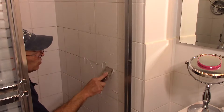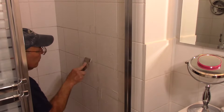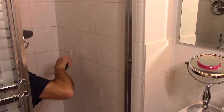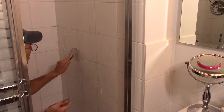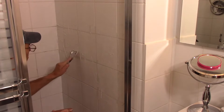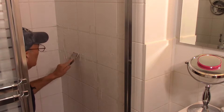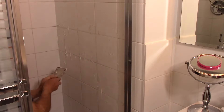You'll want a clean cloth so that after cleaning the tile you can buff it out and get the haze off before it dries. For small surfaces, just a scraping tool or spackling knife works just as well as a float for pushing grout into the joints.